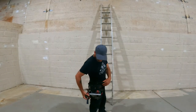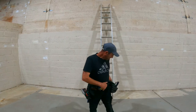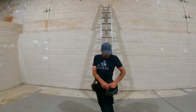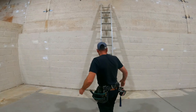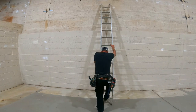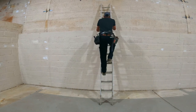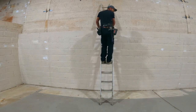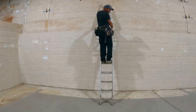As you can see, I have everything in my pouch — drill, square, and everything — it's not going to fall out when you're walking up the ladder. Three points of contact. Also, I want to point out the top three rungs: it's dangerous, you should never stand on those. Keep yourself down from the top three rungs.